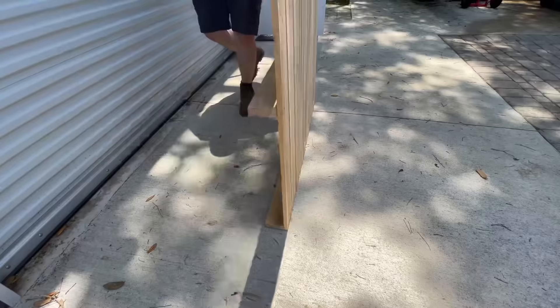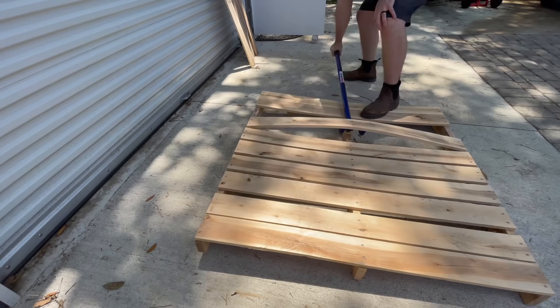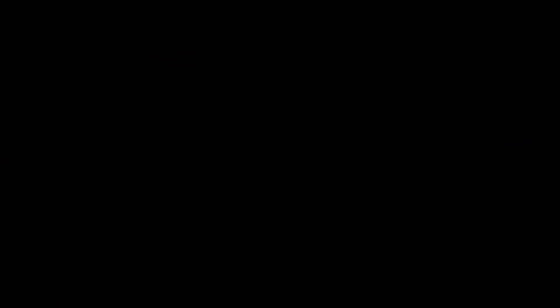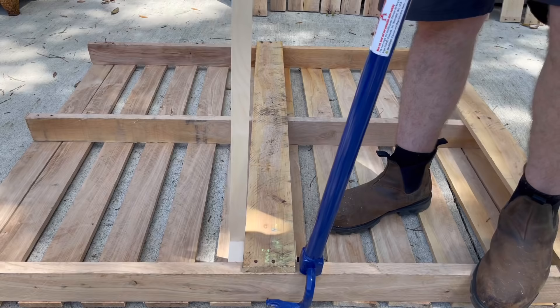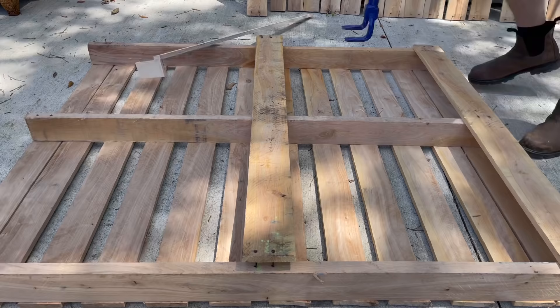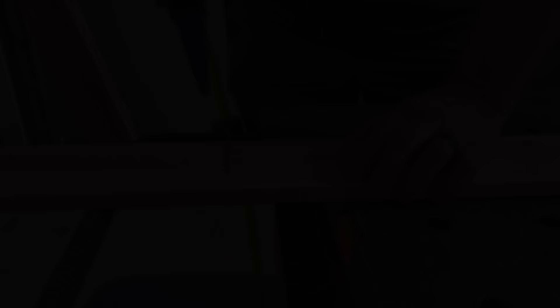With the pallet flipped over, we turn our attention to the top boards. The middle one comes out pretty easily, and the sides do too. I want to explain something I'm running into — these crowbars are great, however they can crack the wood. That's no good. It's because the crowbar has just that one touch point. So I've come up with this: a piece of plywood attached to another stick. It's essentially what the crowbar pries up against, giving you full surface area on those nails so you don't break the wood. A quick little enhancement — with that piece of plywood, you get perfect pieces every time.